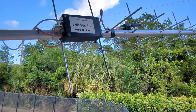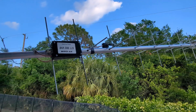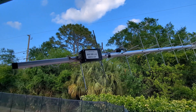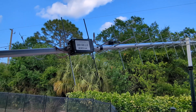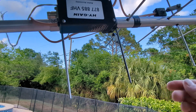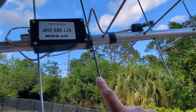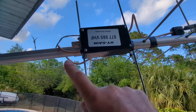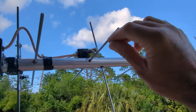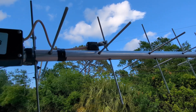Using my RigExpert AA2000 Zoom, I cannot get this thing below 479 megahertz. At 479 megahertz it is 1.01 to 1 SWR. So what I did was I changed this element - I cut it long at 13.2 inches, thinking I can start cutting it off and trim it down. No, it doesn't change anything. Then before I did that, I applied a 9-volt or 12-volt battery to that wire and it switched, and now it was on this driven element. Same thing - like 478 megahertz.